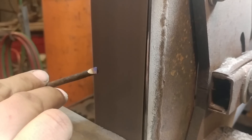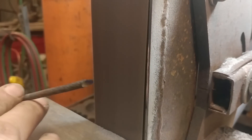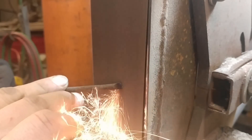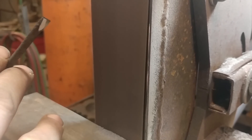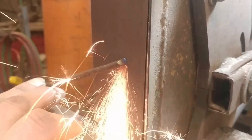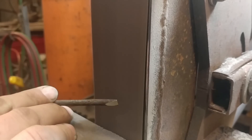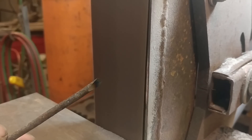I'll flip it over, refine that, and do the second bevel on this piece. You're going to see some bluing at the tip — that's not to be worried about at this stage, because we're going to end up cleaning this up later and heat treating it. There's really no point worrying about the bluing now. We just want to grind this to shape and create that chisel tip. Now we're going to pick one of the sides to go with.